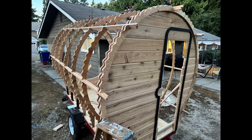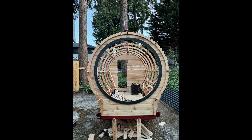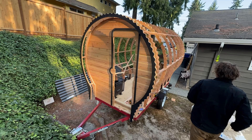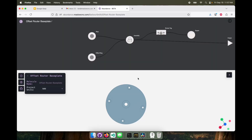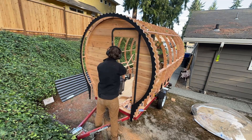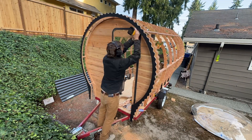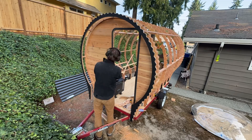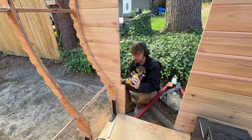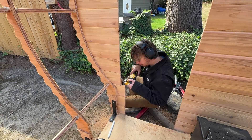Here's how it finally looked — I'm really pleased with it. I am a little bummed that all this cool complexity is going to be hidden inside the walls; you won't see it in the final thing, but I'll know it's there. When it came time to cut the door, I 3D printed a little router bushing that offsets to the inside of the door frame just so when the door is closed there's no gap. There were a couple of places I couldn't reach with the router from the outside so I did them from the inside, then used an oscillating multi-tool to clean up the last bit.